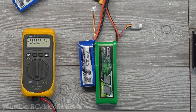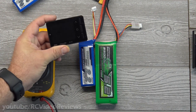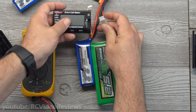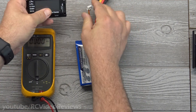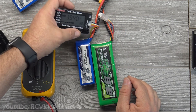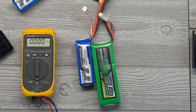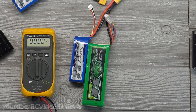How do you know if the volts are different? You check with the voltmeter, your charger, or a balance checker — anything that reads volts. Let's use Chris's new balance checker. We plug it in — overall voltage: 11.81, and the other one says 11.81 to 11.82, a little fluctuation. Since the voltages are the same, you can run them in parallel. When you do that, you get more weight but also more capacity — if I needed a 7400 milliamp-hour pack, there it is.